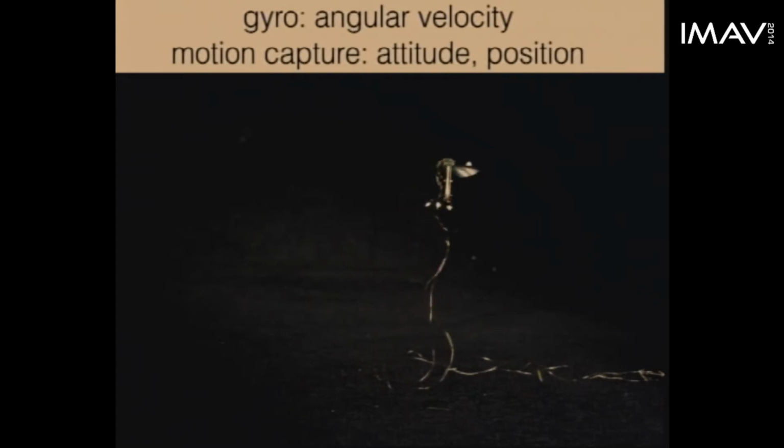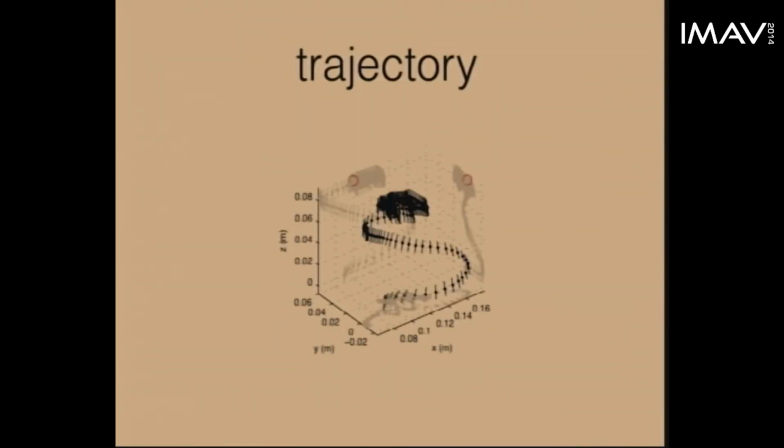So by the way, there's 4 wires going to the actuators in this video, and then another 4 of the same size, 51 gauge copper wires going to the IMU. And luckily, I2C works over these tiny wires. So this is generally working pretty well. We had slightly higher incidence of wing breakage because of the added weight of the gyroscope on top, and had to replace wings a couple times.